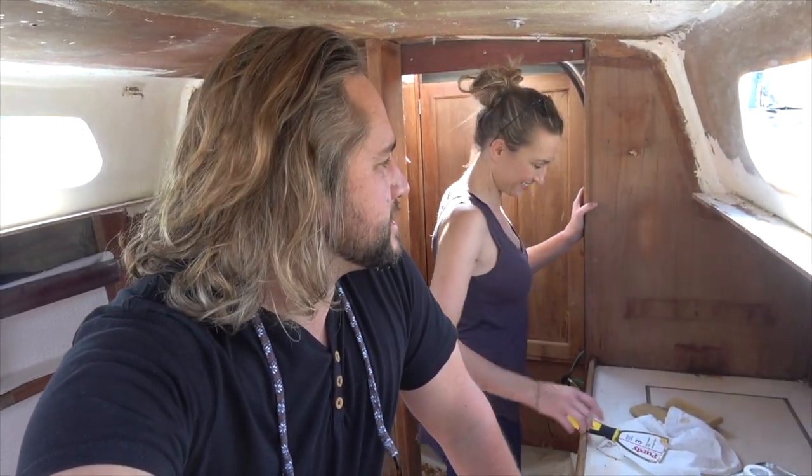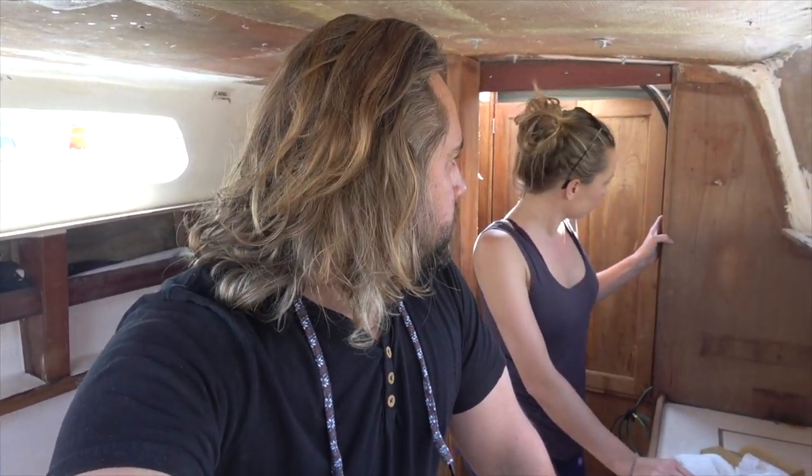And just like that, it's the next day. So today we continue the wood inside. We left the paint stripper overnight. It said that it does not dry, but it does dry, so that's going to be double work for us today. So we learn with this new paint stripper, do not let it dry overnight, don't let it stick for longer than 15 minutes. I'm pretty happy with the state of the wood right now.